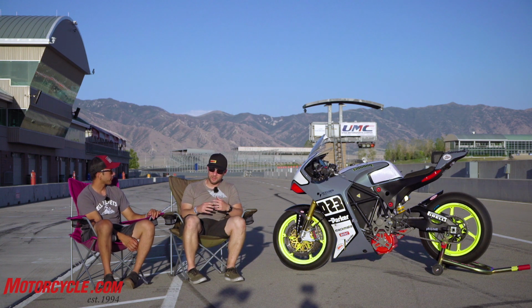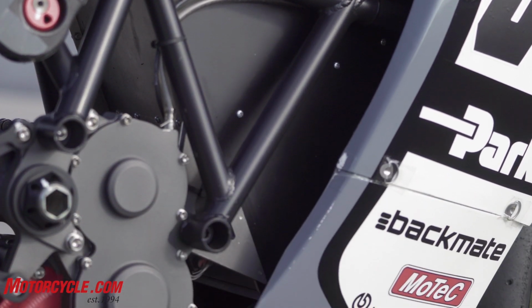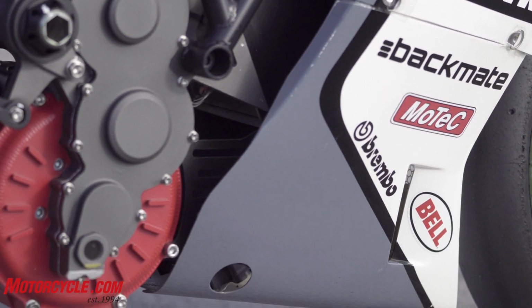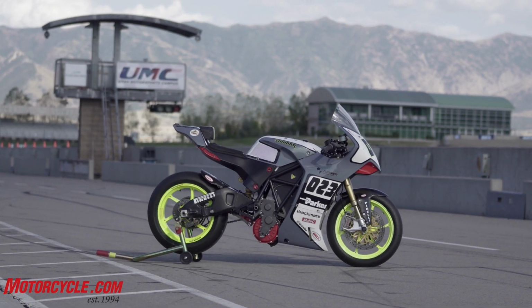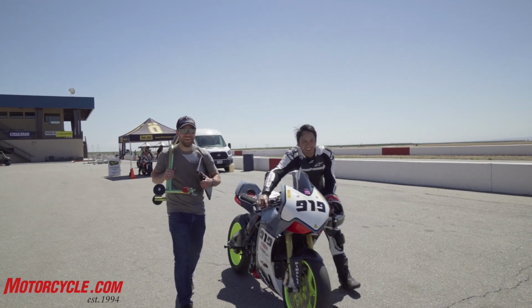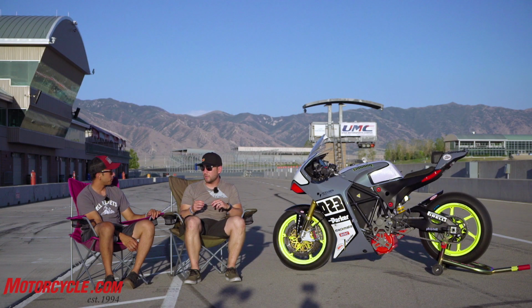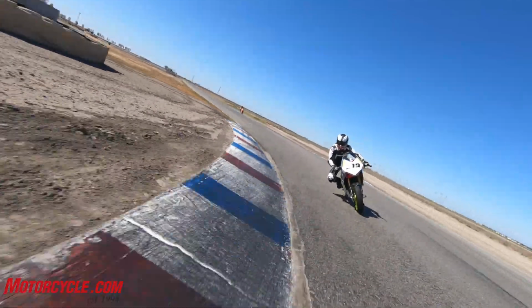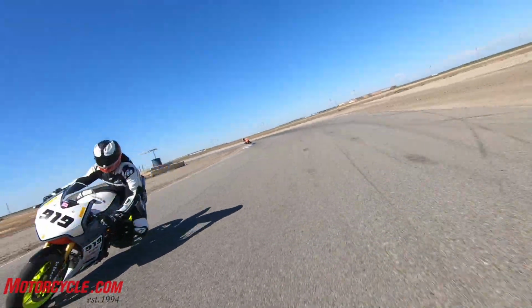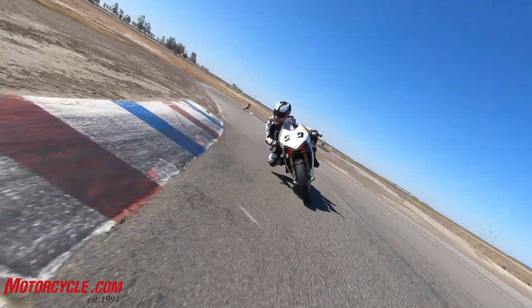Yep. So again, the chromoly tube frame and this custom lithium battery were fabricated by Eli up in Ashland. We had some performance goals. Primarily, we wanted to focus on weight for the motorcycle. So as I mentioned, we wanted to play that power to weight ratio game a little bit different on this bike. It makes about 120 horsepower, but it weighs 375 pounds, which puts it back into a super sport 600cc category power to weight ratio.